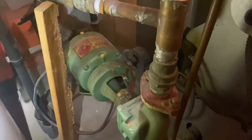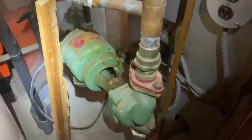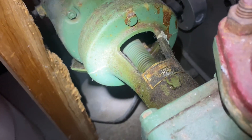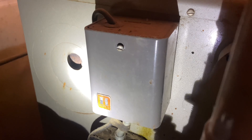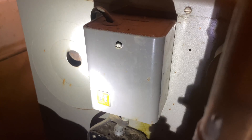All right, back to the regular scheduled program. I'm going to be easy on you today, Peter. What is this green thing called? A circulator. You seem unsure about the answer — you see that thing spinning around in there? What is this thing called right here? It's our relay. Yes. Is it different than the one we just saw? Definitely smaller, because that's just a relay — it's not an aquastat relay. An aquastat relay also controls boiler temperature; this is a zone relay. What is that thing on that black plate called? A transformer. Yes.